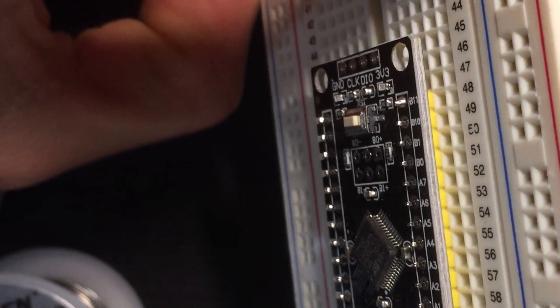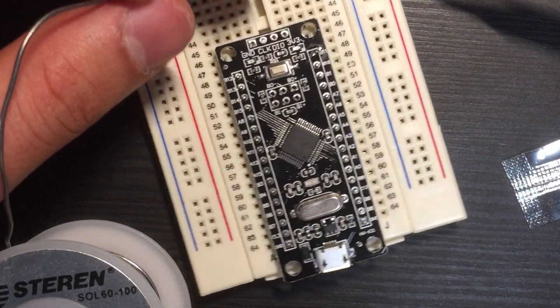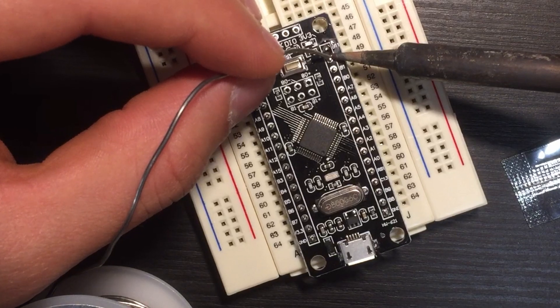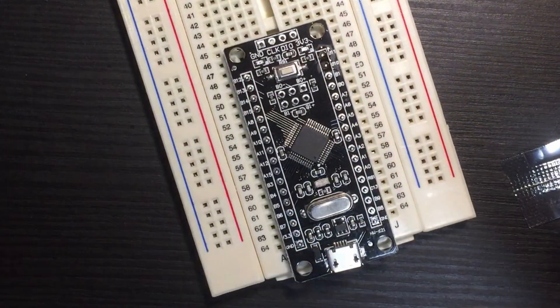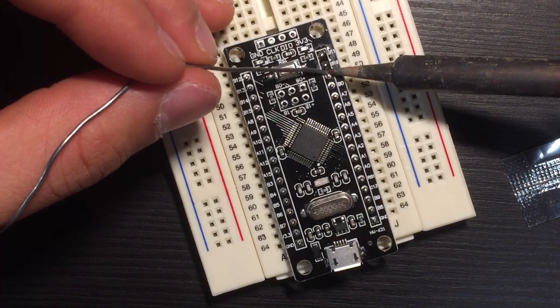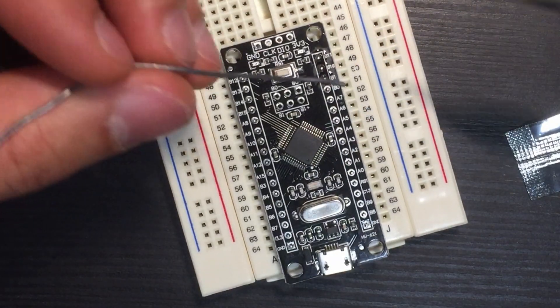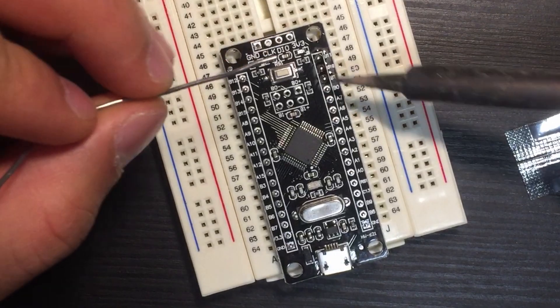You see that it's not balled up — it's like a cone. This is how the solder has to look on every single component. So why do we want the bubbles? If we let the solder bubble, it means the solder is going down through the track. We don't want to leave the soldering iron on too long because the tracks are really thin — if we do, we can pop the tracks right off the PCB.